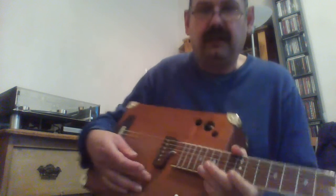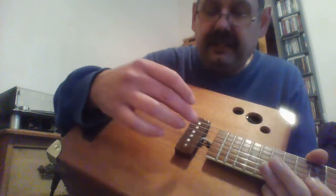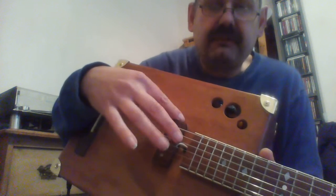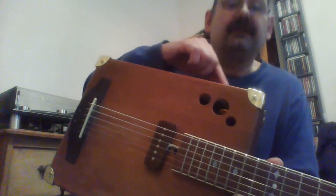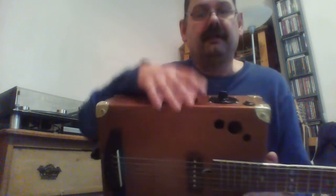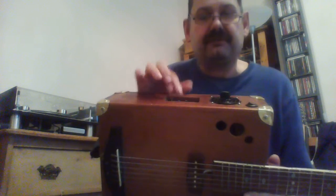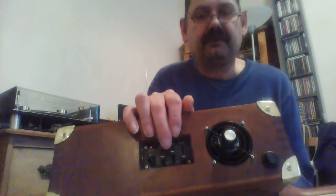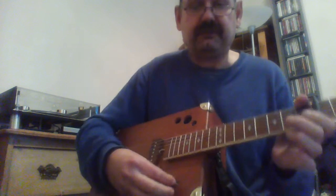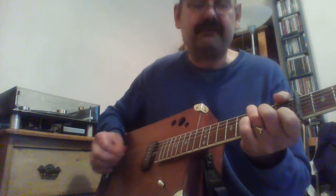With the success of the pickups I made for the Les Pew, I put one in this guitar — it's just on a wooden former with neodymium magnets, which you're not supposed to use, but I've never had a problem with them. It's got only 350 turns of wire, so it has to go through a little mic matching transformer, which is tiny — just taped onto the wire inside. This control matches the impedance of the output to the underbridge pickup, which is also on-offer and quite handy. You can run stereo into a desk for recording, and there's a three-way selector — in the middle you get a much more natural sound.